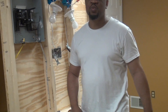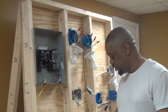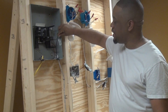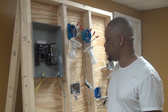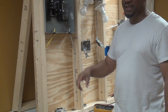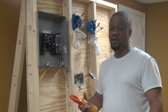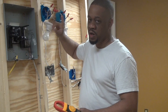Let's look at a couple of reasons why you would want to check current in a circuit. Perhaps you have a circuit breaker that keeps tripping and you need to figure out if the circuit breaker is bad or if you're actually overloading the circuit — that's a situation where you'd check the load on that circuit. Also important: when checking current with either meter, you can only check one wire at a time. You cannot put two wires under the clamp. It's simply not going to work.